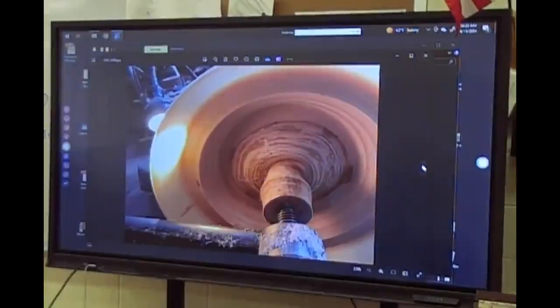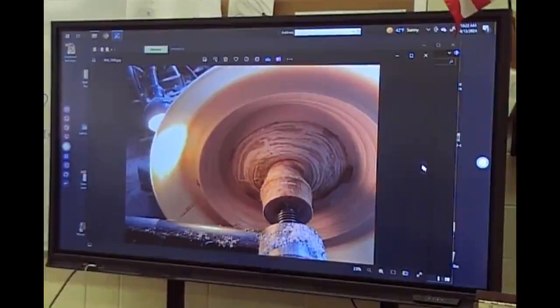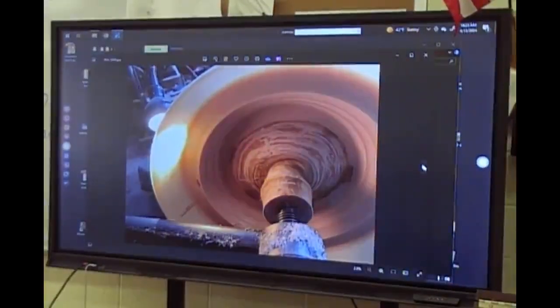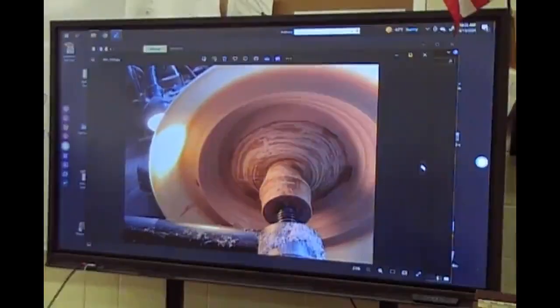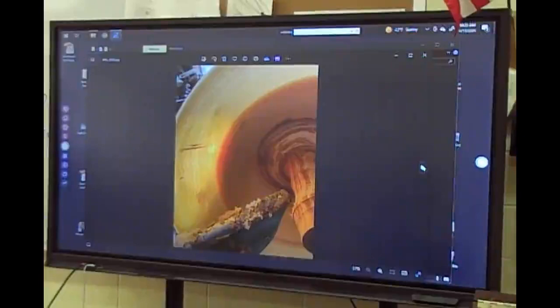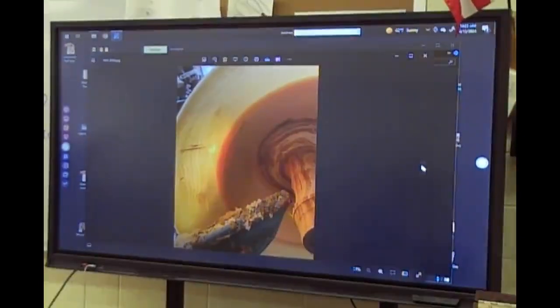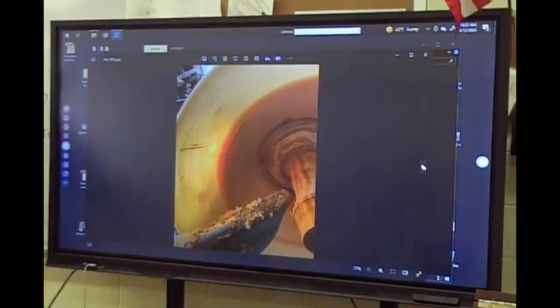Now I've got it in the chuck and the first thing I do is hollow the first one inch. I have a strong light — it should be flexible with your finger, you should be able to move it. You can mic it if you want. This one's 20 thousandths of an inch, that one's 10 thousandths. I like 10 better — the light shines through better. There's the next inch following, and you're just doing it by color, by light transmission. You can only do one inch at a time.